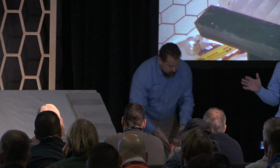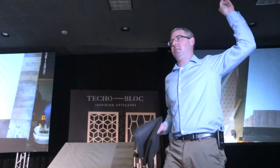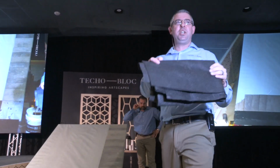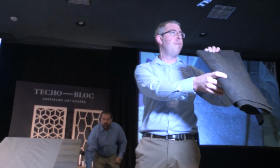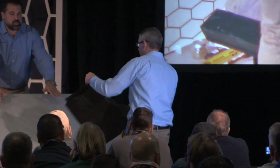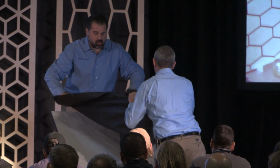Why not? Because there's two different types of concrete out there. You guys know what they are? Cracked and gonna crack. Ready mixed concrete, yep. So we need to put down a geotextile fabric on top of that area. We have a non-woven geotextile that we're going to use for separation. Okay? Because we're going to use a sand bed here, right? Yes, sir. We don't want to lose that sand bed as it flows with water.